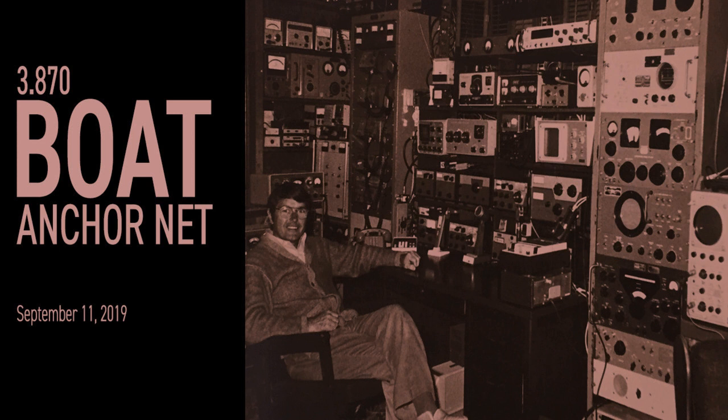What the deal is, this station I've assembled together out of a number of vintage pieces. The station begins in 1948 with a Collins 310B exciter. That was basically a VFO that they used for their 1940s AM transmitters. It's interesting because it's a PTO, a permeability tuned oscillator, which was far more stable than the VFOs of the time. I thought, why don't I pair that up with a Heathkit single sideband adapter from the year 1959. That's a rather primitive exciter, by the way. I'll say that in 1959, except for Collins, most of the sideband rigs were not totally free of carrier or of upper sideband. You might think of this station as the radio equivalent of a 1959 Studebaker. So if it's not exactly right on your frequency, you'll know why.